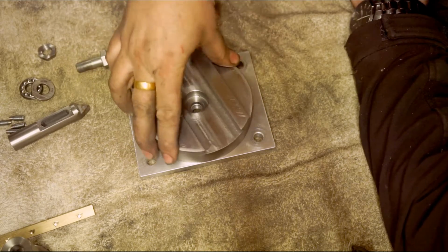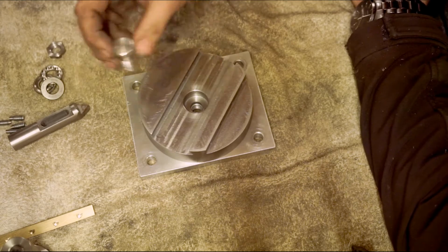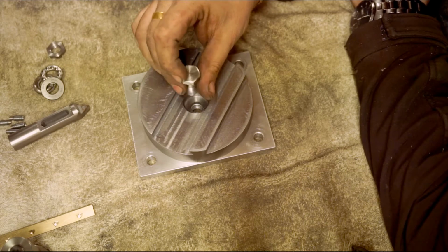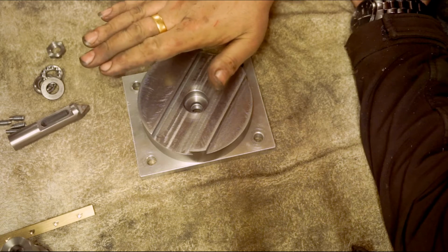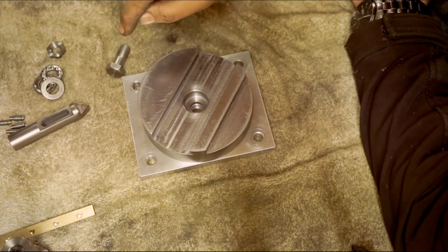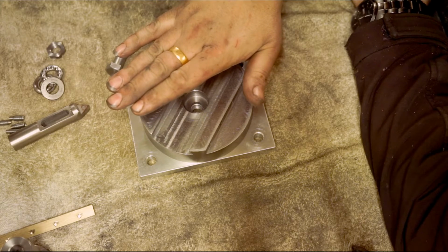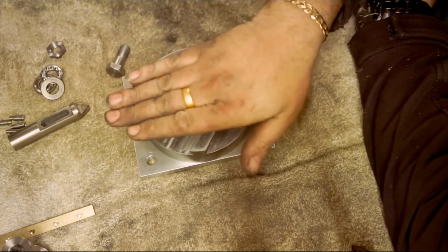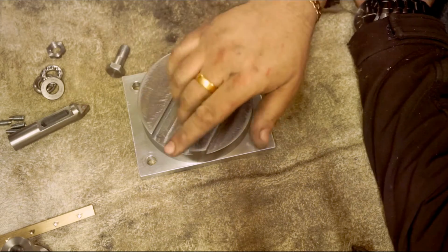So with me turning this round, even though it's got these thrust bearings, it's still loosened itself a little bit, but that's probably why it's got that little bit of flex in it, where I could do the cut and then when it's not under load it springs back up again a little bit, and then when you turn it back round to the start it leaves lines on the work.